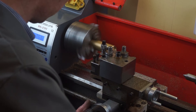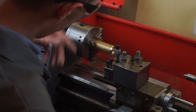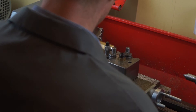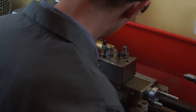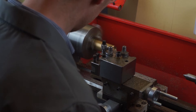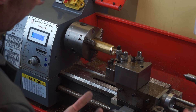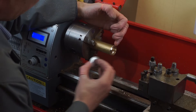I test again to see how we're doing. Now getting really close — I'm going to do a final finishing cut by speeding the machine up and turning the RPM up as well, to give us a nice clean finishing cut to finish off this part of making the movement ring. You might notice that obviously happened quite quickly — it's because the RPM has sped up, which means that the power feed brings the tool in a lot quicker into the material. So now I've got a nice clean fit. I can see a good fit on the case back — so that operation is now done.